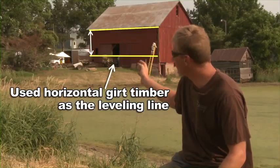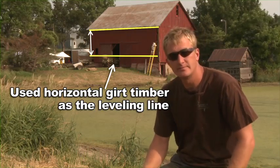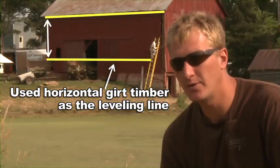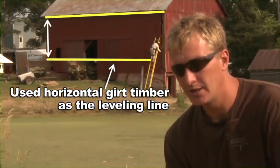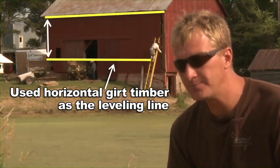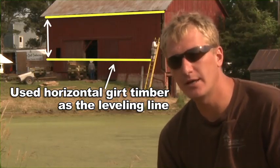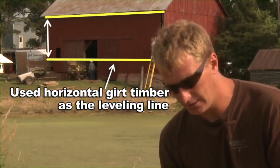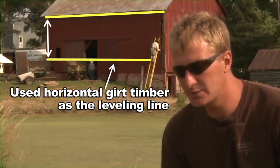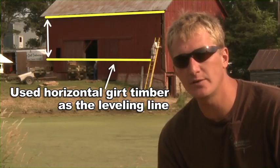On the southwest corner, it measured something like eleven foot eleven. Since we want to be at twelve foot two, that's a three inch lift. We actually went an inch past that number, keeping the laser spinning as we lifted until the tape measure read twelve foot three at all six lifting points. That leaves us one inch high, so when the homeowner comes in and pours his piers, all he has to know is that he's one inch below the bottom of the sill plate.